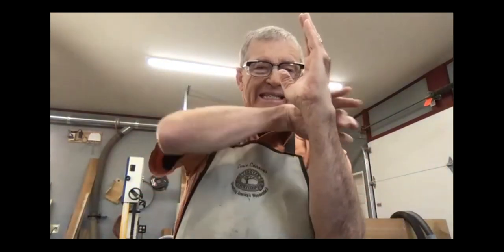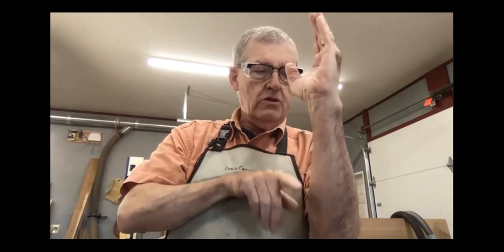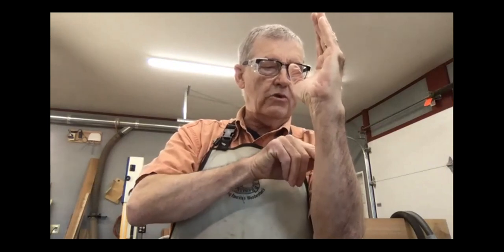I wouldn't have tried this without that course under my belt, but the modern method is to bore cut sideways through the tree after you cut the notch and establish the hinge, then go around and cut in from the back, the second bore cut, and then cut these two back straps that are left away. By doing that, you take all the tension wood out of the center, because especially if a tree is on a hillside like this, you will have tension wood here and compression wood here. And if you were going to fell it uphill, you'd cut your notch, and the minute you start cutting through here, it would just split right up the center of the tree. It's called barber chairing. By doing that bore cut first, you eliminate that problem because you relieve all that tension. So it's a better technique.